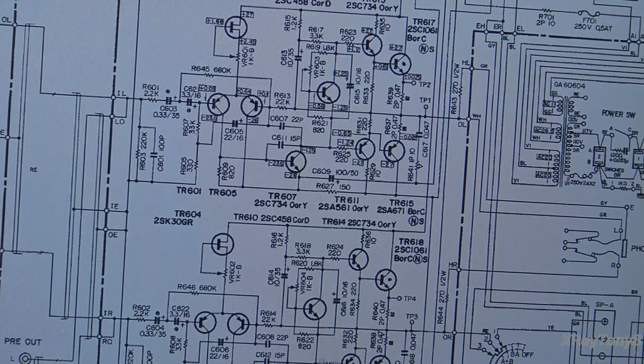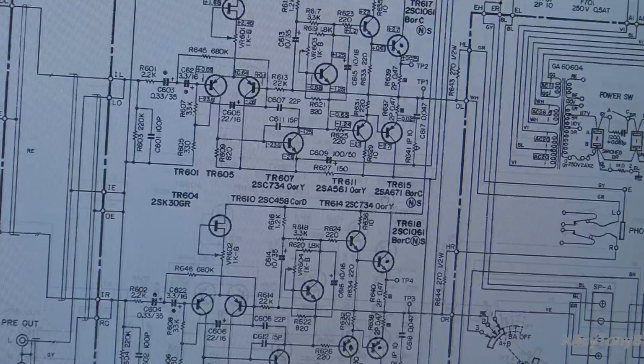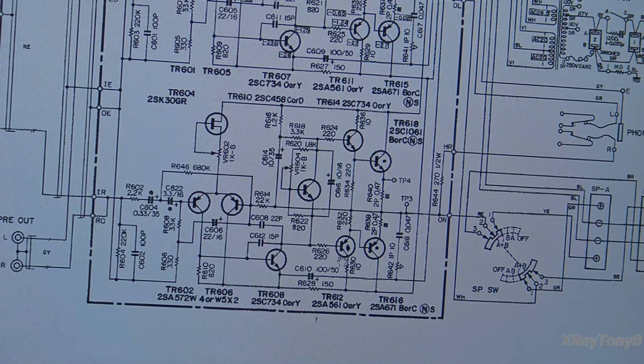And then there's also negative 26 on the other channel as well. So you have 26 volts across that 50 volt cap, which is normal. But if that capacitor had very high ESR, I could see how that would cause current to flow through that center tap, pop that fuse. And that's where I think our problem is right now.